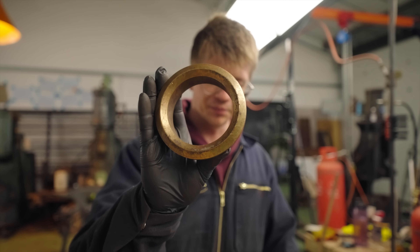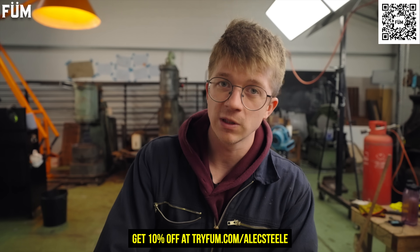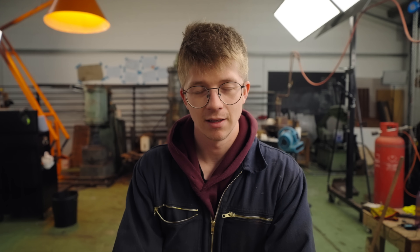This face here is contacting with the power hammer in quite an important way. And it has also contacted that errant screw in quite an important way, because it is just utterly destroyed. My assumption is that this needs to go in the lathe to get cleaned up. This shaft definitely needs to get cleaned up, because otherwise it is just going to be abrading away these lovely bits of bronze and making them even worse. This bit of bronze might need to be completely remade. Please circle the like button and subscribe so you can stay up to date with this series — and I'd love to hear from you in the comments. Check out today's sponsor at tryfume.com/AlexSteele. This project is going to be a behemoth, and I am panicking lots. See you soon.